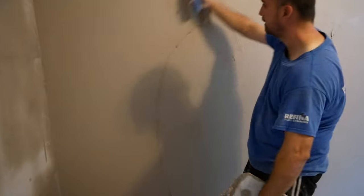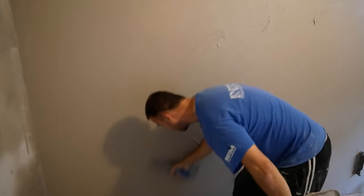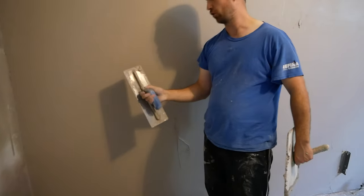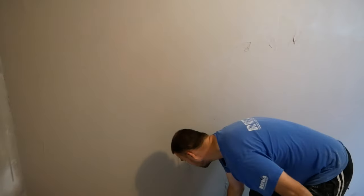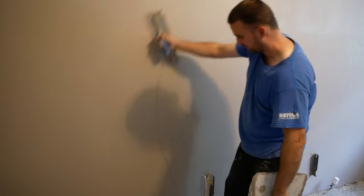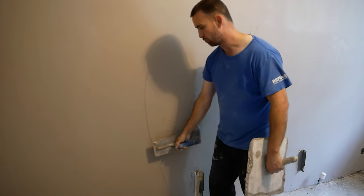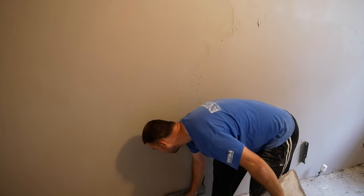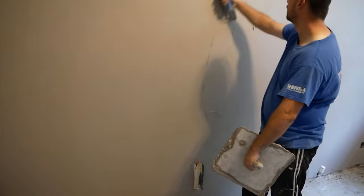This wall in particular has got a wee bit of fall in it, so in about 10 minutes it will definitely need a quick troweling. You can notice it's coming in very neat because it's tightened — and that's by design, we're doing that on purpose. Because if we left it and just slapped it on, when we come back that plaster is going to be very hard to press in because it's been drying. So it will have to be neat — you'll have to be on the ball.